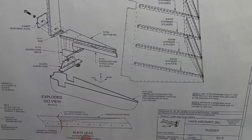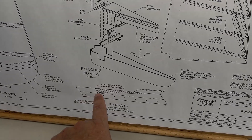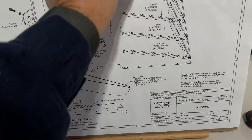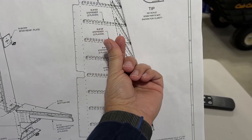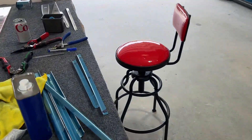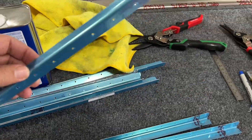This is sort of a side view of those strips. This is where the cut between the two separate parts goes, and the shaded area needs to be removed because as this folds closed like a taco shell, these need to be narrower where they meet and come together. So I have to separate all of these.